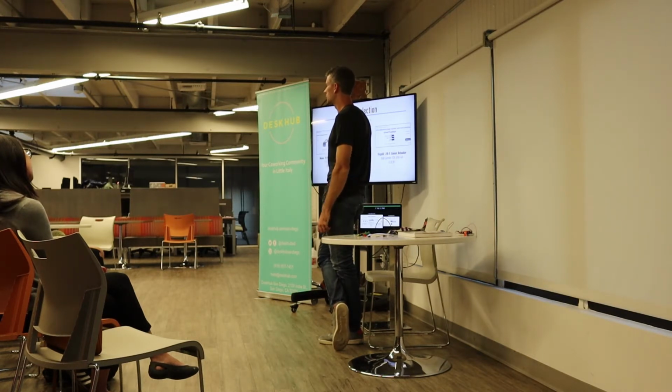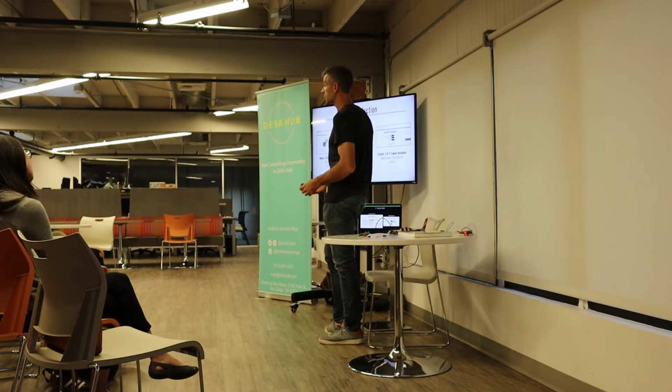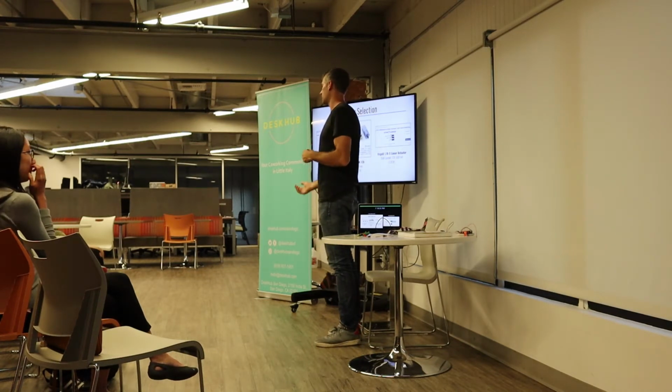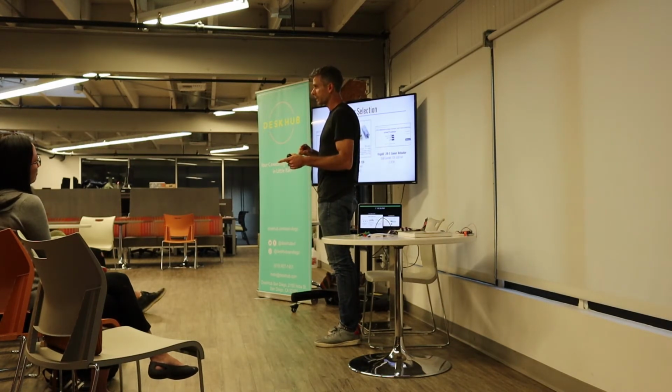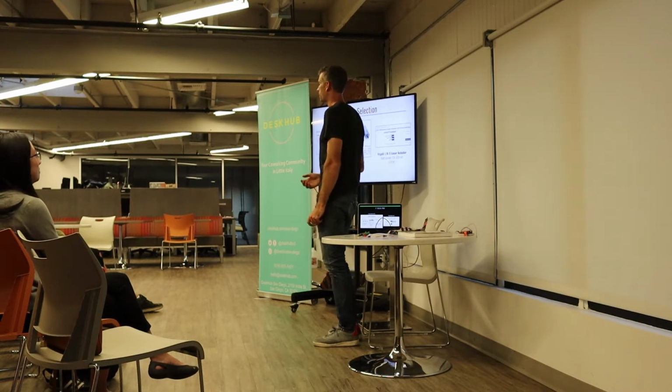So you just do a little simple calculation, and that helps you ballpark the number, but then you end up with variations on it. So you can do some math, and most of the time if you can think of a simple version of your problem, you can end up Googling to find some example where someone did the math for you. And if you simplify it enough to use numbers in their equation, just throw in a safety factor of 2 or 3, which means whatever torque they say, multiply it by 3. And if you have that much in your motor, you're going to be okay.